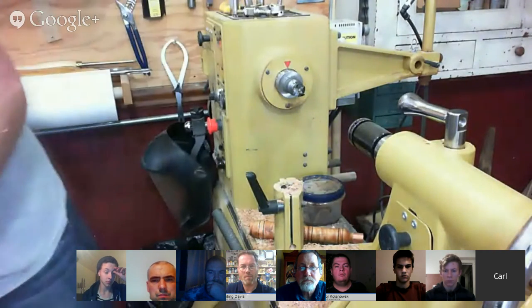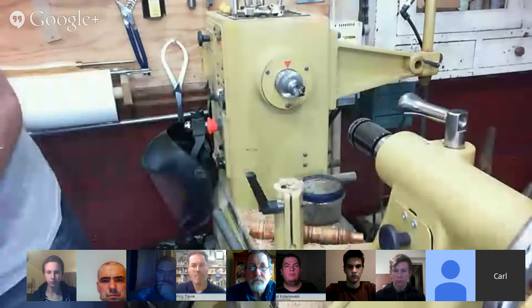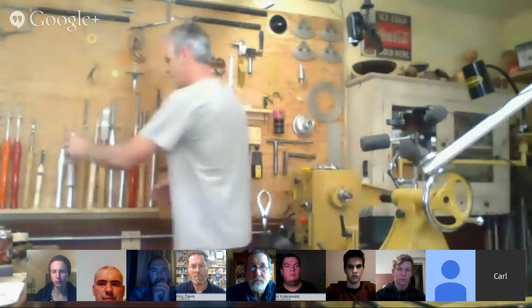Let me switch back here real quick. I'll show you that. You okay there? All right. So yeah, it completely depends on what you're doing. So this tool here is just a small little detail tool. You're not going to be getting in there and trying to take out a lot of material with it, just for doing little detail stuff. So you don't need a big handle for it. Same with this little carbide cutter there. It's just for doing small stuff. So you're not going to be hogging out a lot of wood.